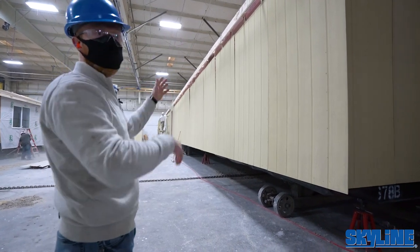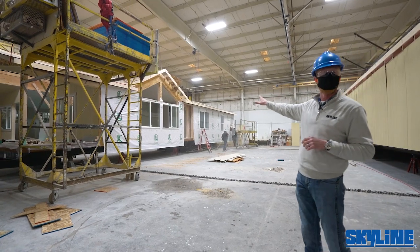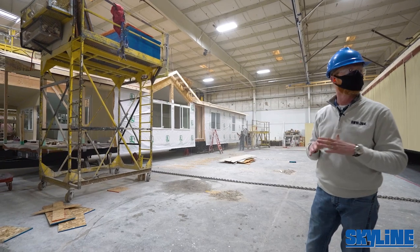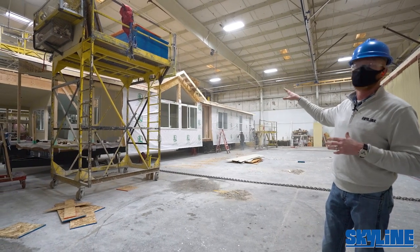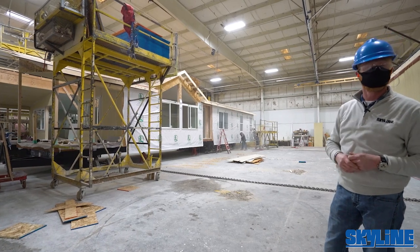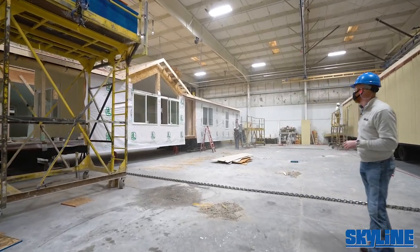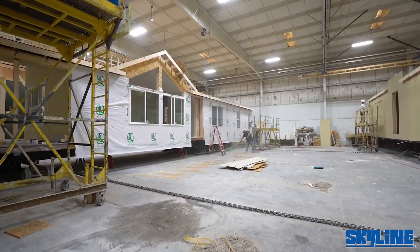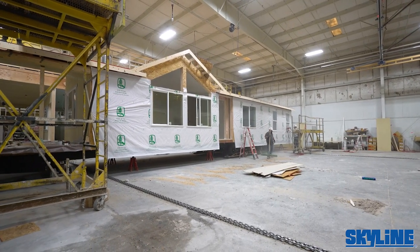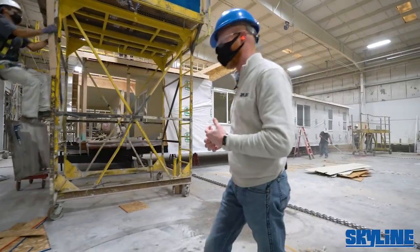They buzz out the windows and door frames as they go. That's what we call a sky view dormer — that application replaces the standard 10-foot dormer and gives it a 12-foot trapezoid window, creating an aesthetic break-up inside and out. Looks like they've done a recessed entry on this one as well. Windows are being installed, so it's really in the phase where roofing and sheetrock work on the inside will start.